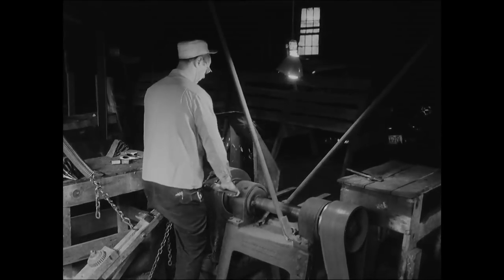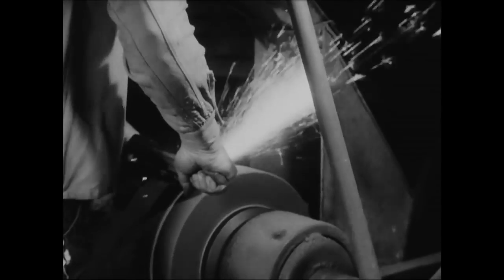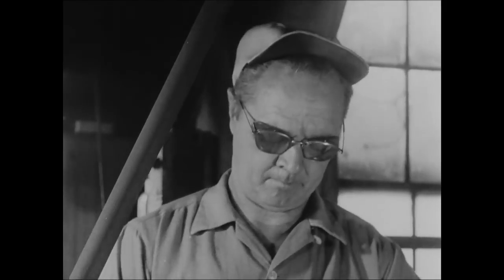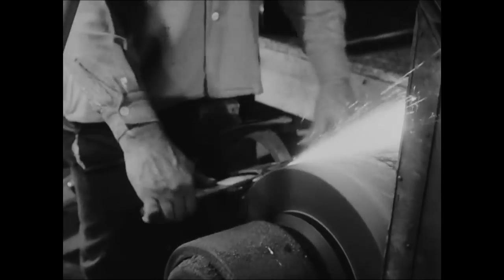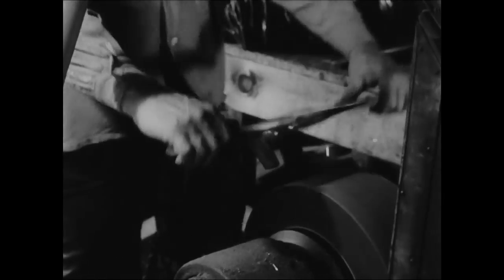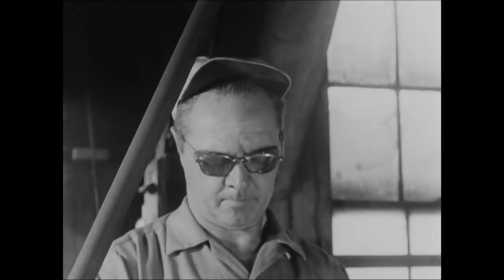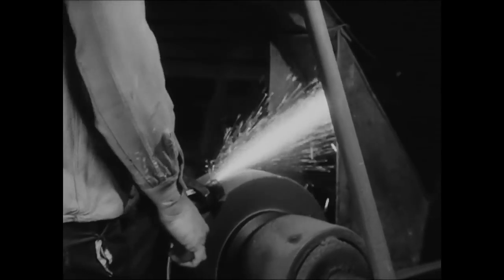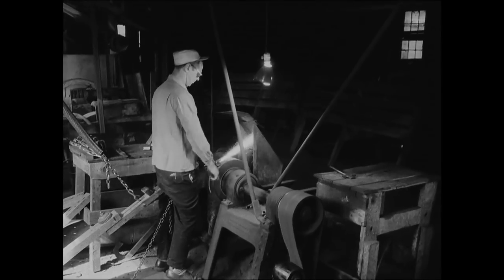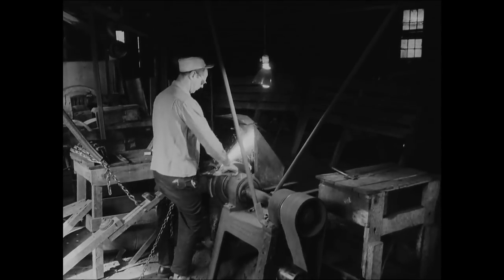This first grinding is called raising, and here Wood further shapes the axe by grinding off the top of the head and the sides, and then grinding the bit down to the proper edge for tempering. The position he sits in gives him greater pressure between axe and stone, and a lot more steadiness, all of which help him grind each axe to near duplication. The grinding wheels Wood uses are made of carborundum and have replaced the traditional sandstone wheel. An average sandstone wheel used to measure 78 inches in diameter and weigh nearly 1.5 tons.